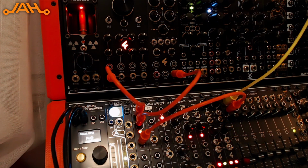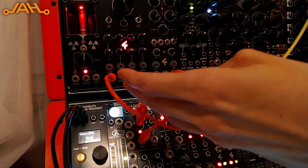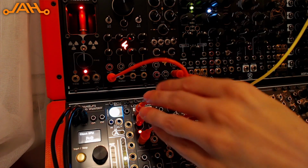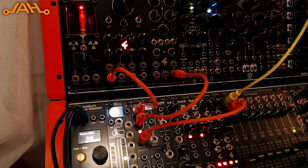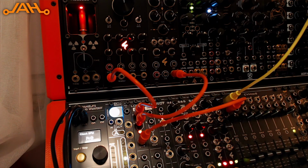Okay, I have now created a sort of audio patch with these. I'm feeding two oscillators into it. Specifically, I'm feeding the ST modular silene oscillator and the ST modular honey eater module. Feeding them into the LOGx module that has the AND gate, outputting the signal into my CV mod 8 so I can correct it a bit. I would like to add that it will have a massive DC offset because this is a logical module, this is not an audio module. I'm just offsetting it down a little bit, and then I'm outputting it to the sound. So let's hear how it sounds like.